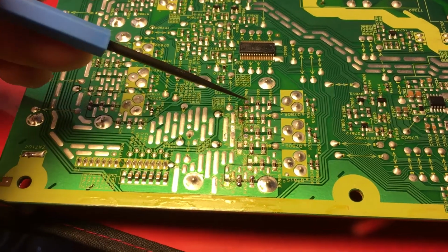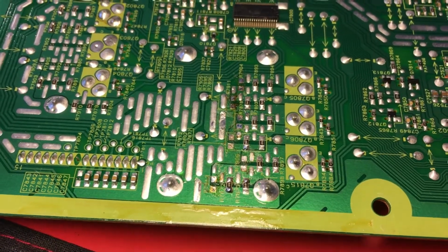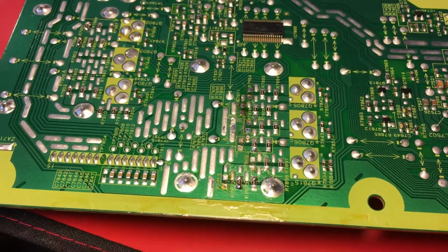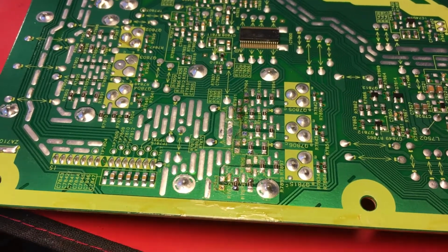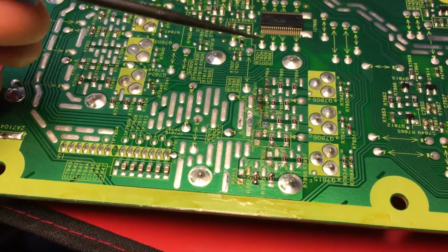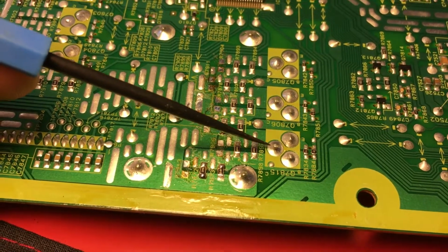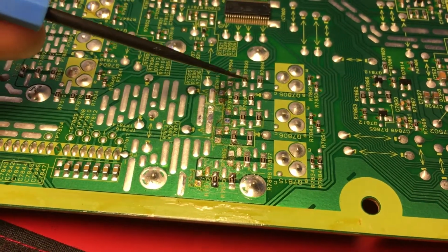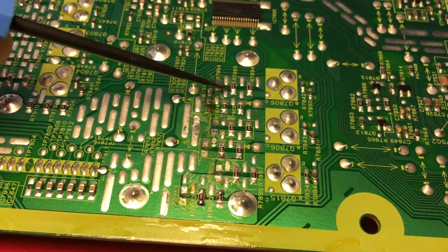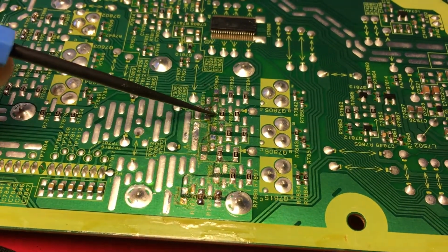It's called local dimming. So what we can do here, and the purpose of this video, is just to do a wee mod to the backlight, so the overall backlight current is just less. It's lower, and that makes the LEDs more reliable. It's like a fooling circuit. We can zoom up here, and from the collector of each of those transistors, the voltage goes to a set of resistors and then goes to ground. Each of those resistors is 2.4 ohms, and they're connected together. They go to a wee island here, and then another resistor, and then to ground.